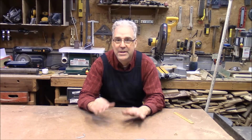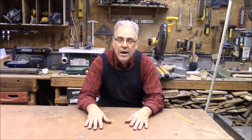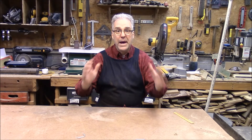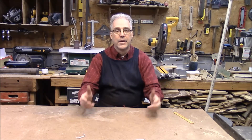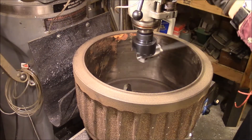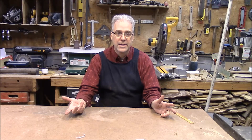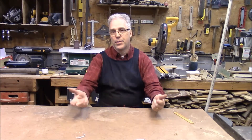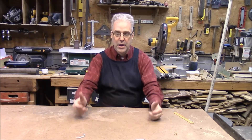I sharpened it and then did what I should have done in the beginning — I went to the internet. Some of the guys were saying that a brake drum is basically just a big bell, and so when you're cutting it, it rings — and you can hear it in the video, it's ringing. The professionals that turn drums have a big heavy-duty rubber band they put around it. I didn't have any of that, so I used bungee cords.